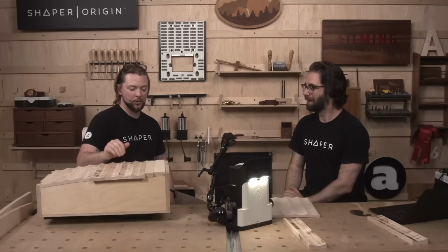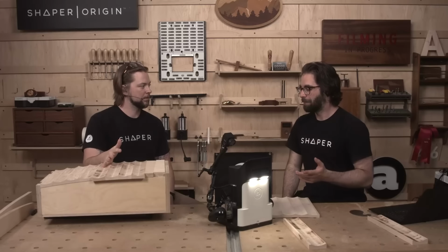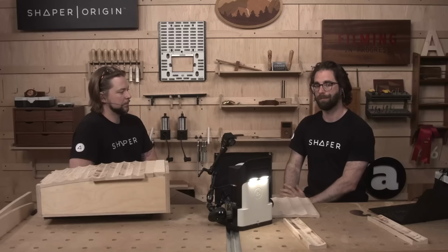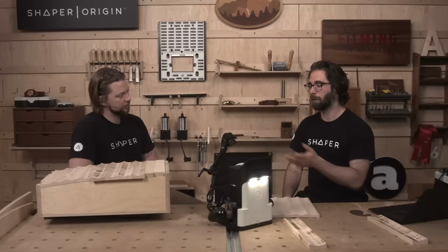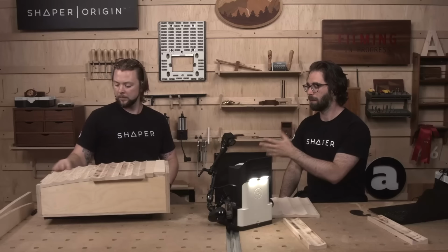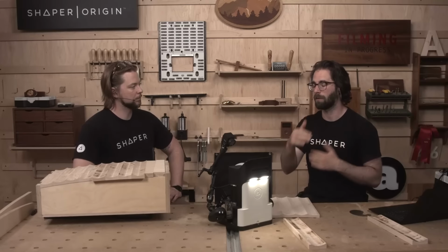This is such a cool glue-up fixture. It really is. And honestly, especially with all the files that are provided, it's not that involved to create. And in those files, in the shop drawings, there's an exploded view of this so that you can know exactly how it goes together. So I think the next step is we're going to use this, which we already used to glue up the one door, in workstation to mortise the hinges in that 82 degree side, which you would basically have no way of holding without a fixture like this, because that angle is just so strange.